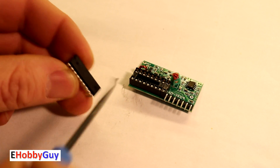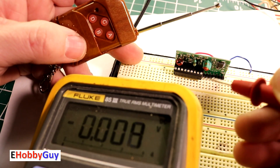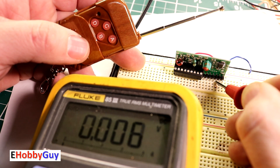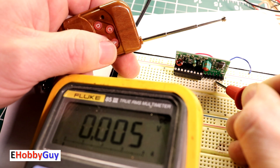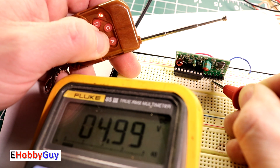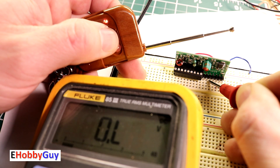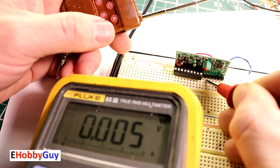I placed the original chip into the socket, aligning the notches for proper orientation. Testing the pins: pin 1 is ground, pin 2 is 5V VCC reading 4.99V. Pin 3 is channel A — pressing channel A brings it up to 5 volts and it drops away on release, so that's momentary. Channel B: zero up to 5 volts on press. Channel C and D also both go to 5 volts when pressed.